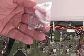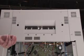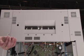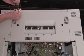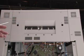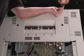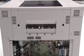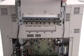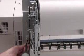Part of the sorter hardware is two special screws — they are small screws with small circular bushings. The spacers aren't attached to the screws, so you want to be very careful not to lose them. I'm going to install them loosely by hand with a regular screwdriver. Now I'm going to bring the top ejector unit in and put it on the screws I just installed. Now I'm going to install the lower screw and tighten both sides.